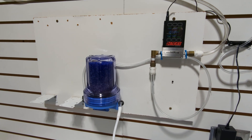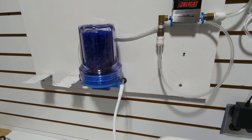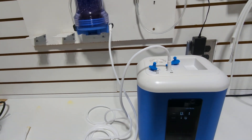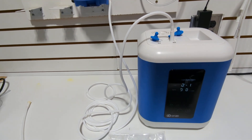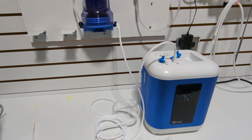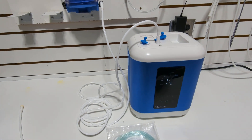Now we're going to want to wait until the air is purged from the hose and we just want hydrogen in there. If we don't purge the air out, we will get a bad reading. So I'm going to turn the flow up here for a second — we're going to purge all the air out of the hose and out of the canister, to make sure that we have just hydrogen in our hose so that the meter can correctly read the amount of hydrogen.